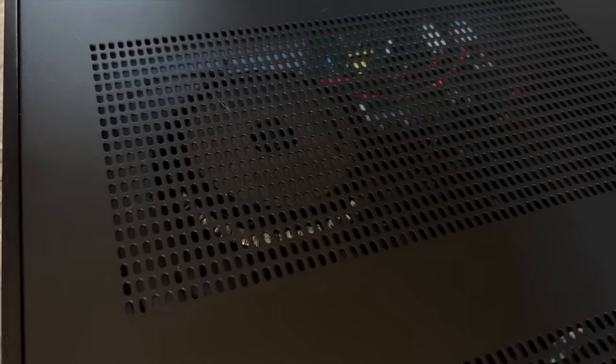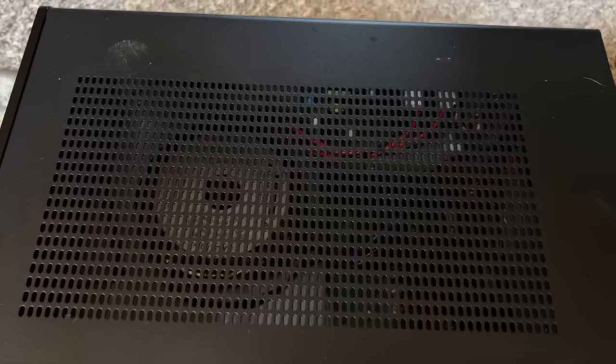Not super heavy for a five-channel amplifier, but if you look down into the vents — I try to get some shots of it — you can see the big toroidal transformer in there. The toroidal transformer on the five-channel is indeed bigger than the toroid on the two-channel, which is a good sign. It is indeed bigger — this is old school.